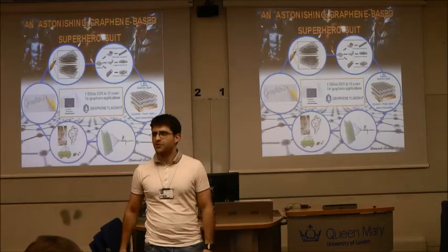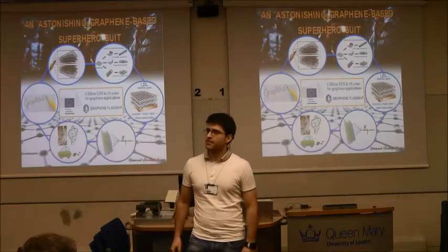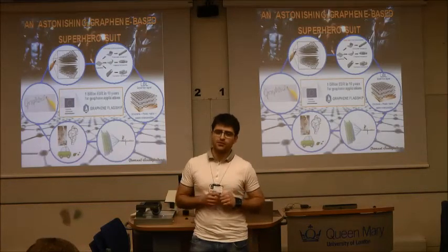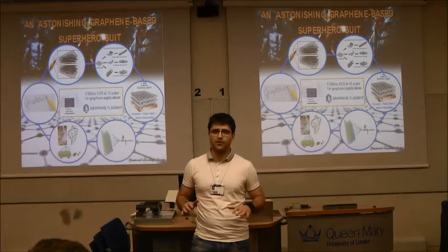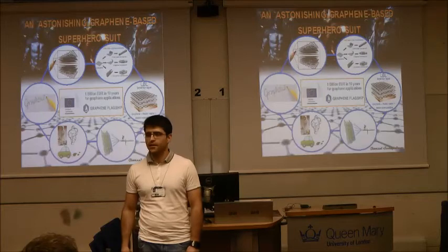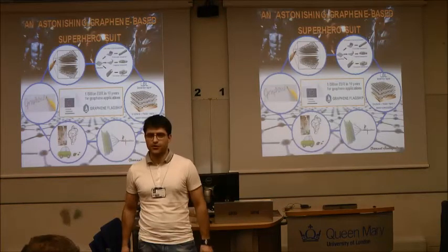For example, by introducing them inside a plastic matrix. Unfortunately, this is really difficult because graphene tends to stack up in a useless configuration that doesn't allow you to fully exploit the bidimensional properties of planar graphene. So I'm studying this aspect in my project, and one of the most promising synthesizing techniques is the so-called layer-by-layer, in which you create one layer of polymer and one of graphene step-by-step, obtaining a well-ordered planar configuration.